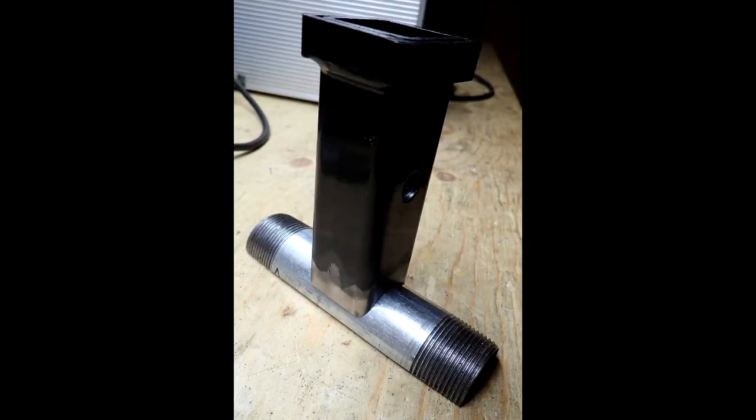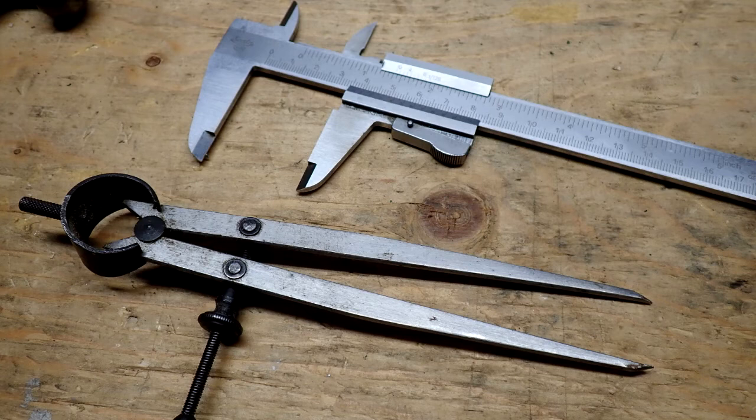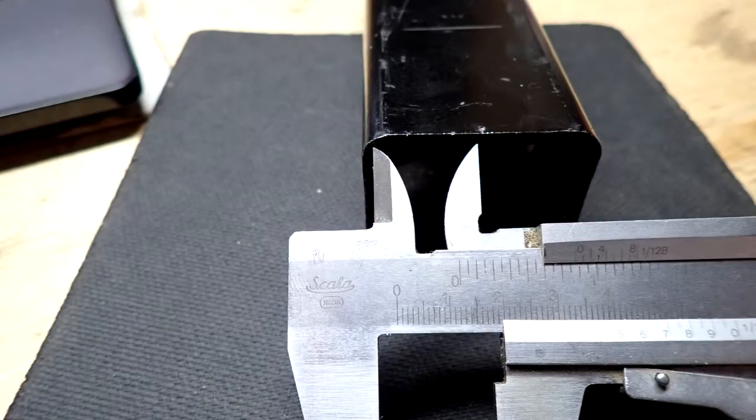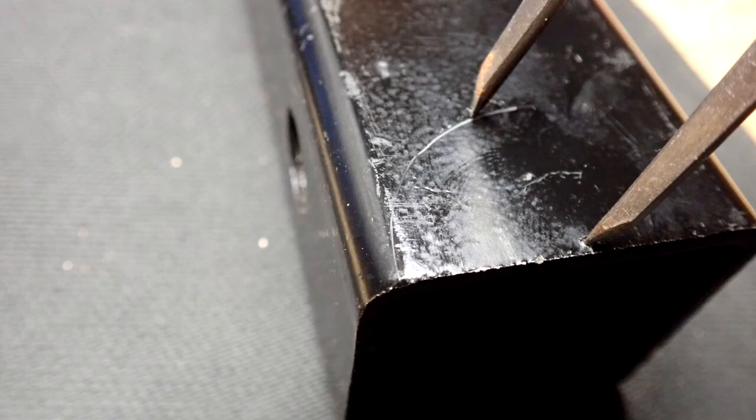Here's the receiver after I did the work cutting it to length and taking the radius out for the pipe — sorry I don't have any pictures of that process. Essentially before I cut the receiver to length I used an inch and a quarter hole saw on both sides, then cut the pipe at the appropriate spot to make it the right length. As an alternate method you could use a grinder cut-off disk, files, and other tools, but if you don't have the power tools you can use a scribing compass and calipers — just measure out the center point of the receiver, about 21 millimeters from the inside wall, make a punch mark, and scribe a semicircle with the compass.